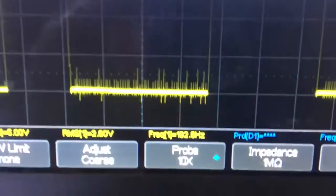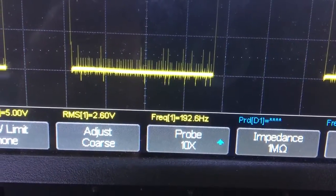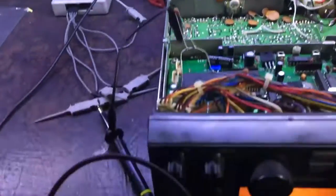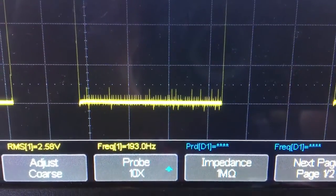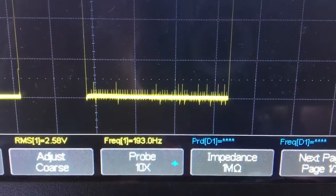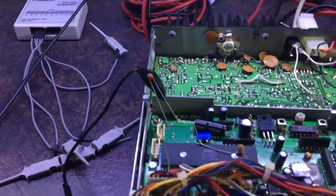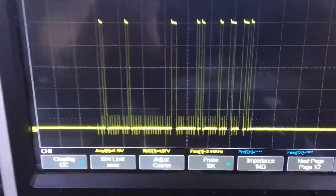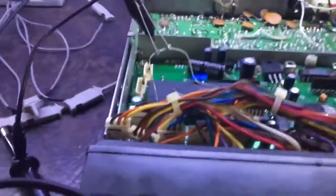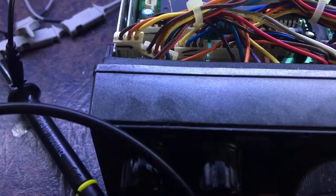I'll remove that connection to the second pin and re-trigger — the ringing is maybe a fraction worse, probably about 0.75V, so it is radiating through the chip. I've now moved the probe to pin 3 and we're getting about 0.4 of a volt ringing at worst — so that is making a difference. Measuring the second pin again with the filter in place, it's back up to about 0.7V. So the ringing is not just radiating — it's actually on each pin, probably originating somewhere else and coming out of the chip.